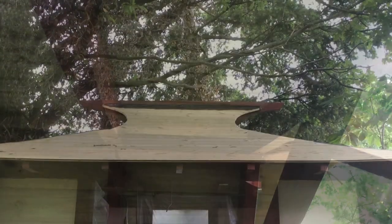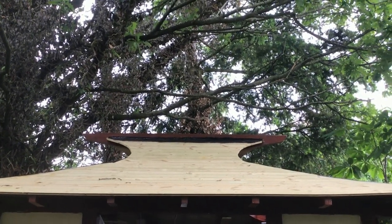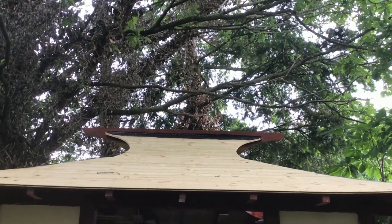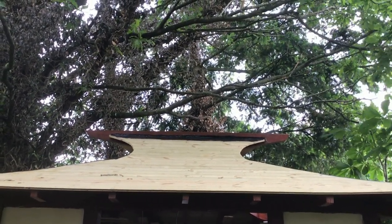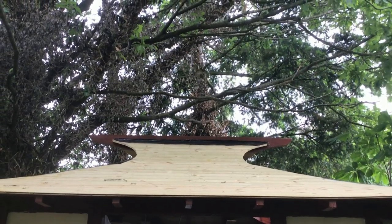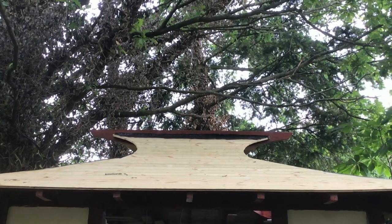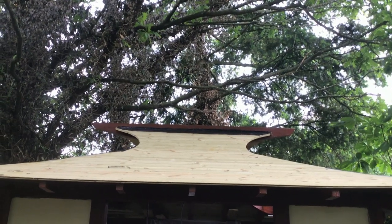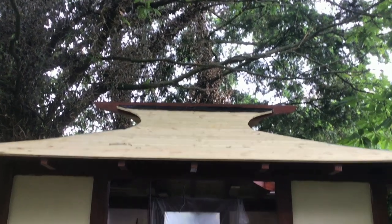And then on top of the ridge, down where the roof cladding meets the ridge, that's the brown bit, I've put waterproof sealant in between there. And now what I'm going to do is to put that Bostik flash band. Now the primer is a black paint that you can see there, and so I've got about 25-30 mil on the ridge and about 100 mil down on the roof itself, so that should be totally sealed. I've got a seal underneath the cladding inside there, as I've just shown you.